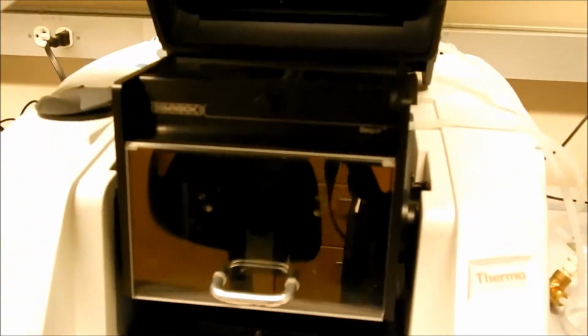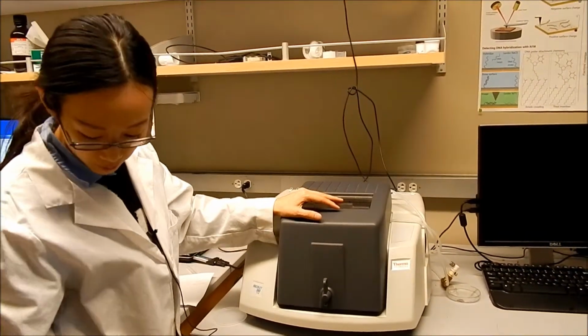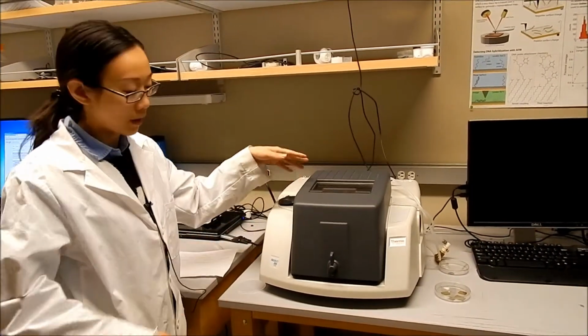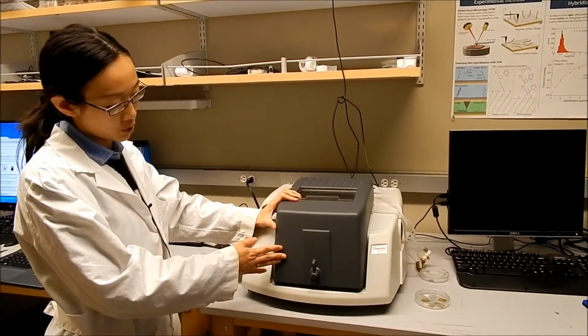That's telling you right now it's hitting at about 85 degrees from the surface for the infrared light. And so this is the reflection chamber, and you hear this purging sound because we want to remove carbon dioxide and water in the measurement, because especially water has a really strong absorption in a lot of wavelengths, and they have these really tiny spikes for broad range. So when we measure the samples, we want to make sure we get rid of the water first.